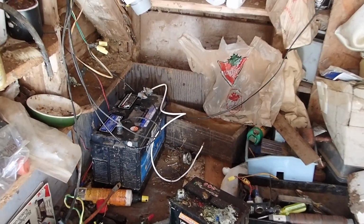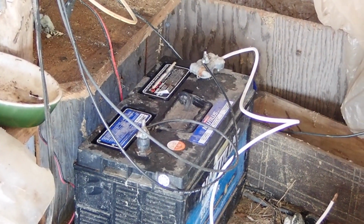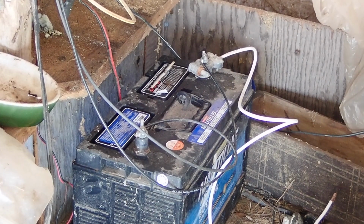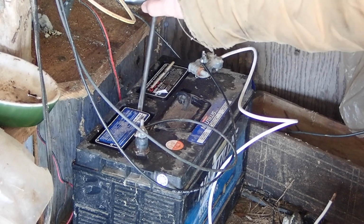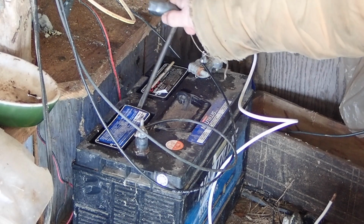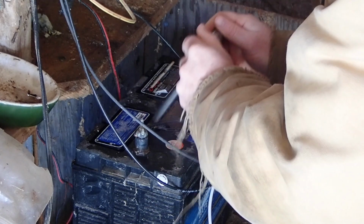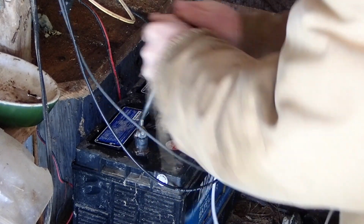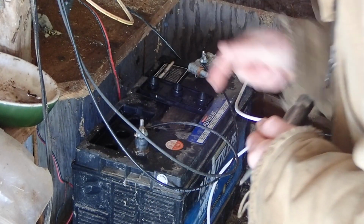If I zoom in to this one, this is really a very simple how-to. It's quite simple. You should probably be wearing gloves for this. Of course, I never follow any safety instructions. So all you gotta do is pop these off. These caps just come right off. Now I think I broke mine slightly when I took it off the other day. Plus, it's below zero, so these things don't want to pop off. There we go. And you pop this cover off to reveal the holes, and then you can look inside the holes to see the level of the water.